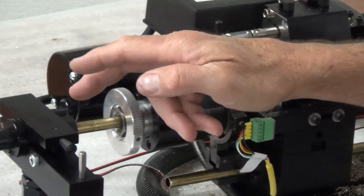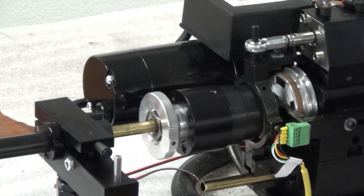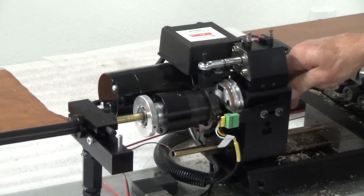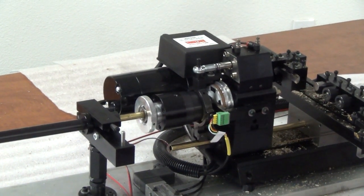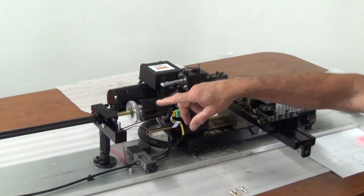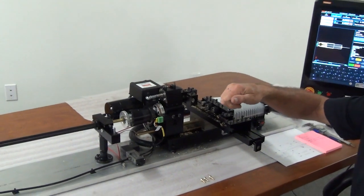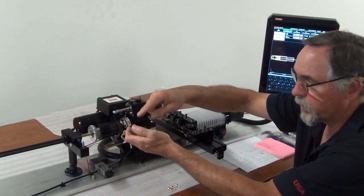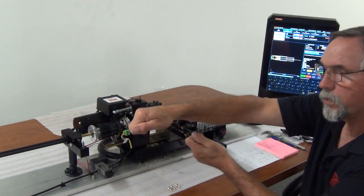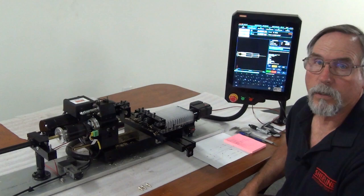When you put up some bar stock in this, the bar pusher has 2 O-rings on it that seal it to keep the air behind it. And obviously if you're spinning this up at 2800 RPM and that bar is inside our bar pusher, it's generating some heat. So before you put the bar stock into the end of the bar feeder, just squirt some 3-in-1 oil in there. You can lift it up, spin the bar around so it coats the inside, and then push your bar stock in there. And that'll keep the inside lubricated and keep it from sticking on you.